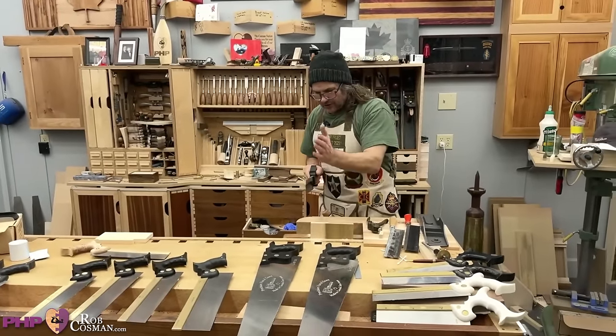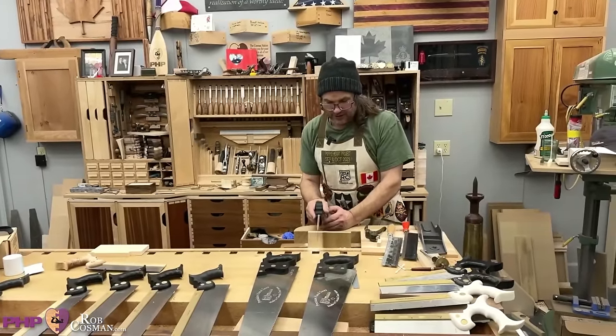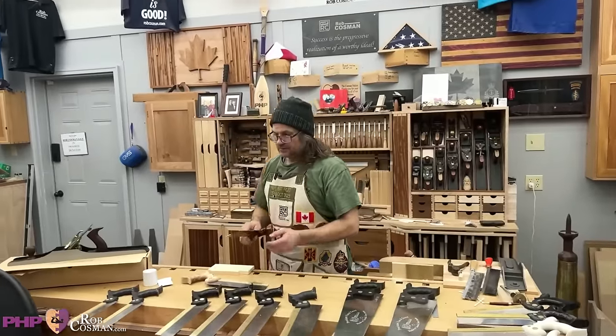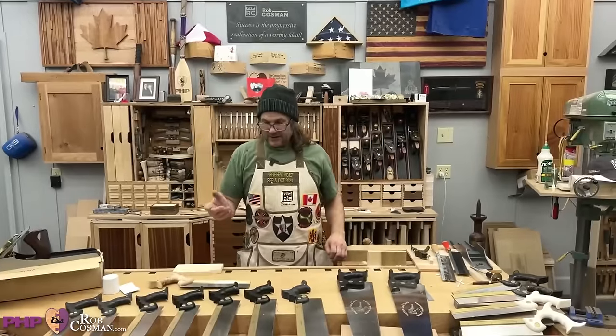And when I no longer have any drift, I'll just keep doing that until I get the amount of the kerf, the exact width that I want, which is just literally 2 thou, 3 thou, 4 thou, somewhere in that neighborhood. And that's how I would do it.